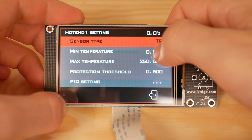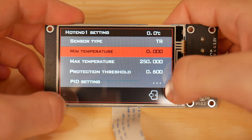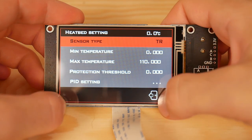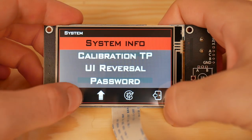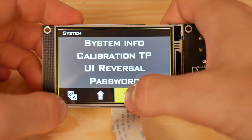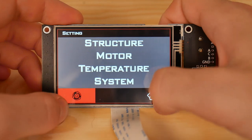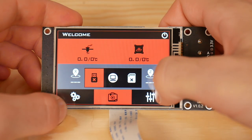It's got quite a few different preset color options, which is cool — doesn't affect overall functionality, but if you're building a cool machine, having the ability to control the overall UI is really neat. The board also has an LED hookup slot, which I think is pretty cool. Under the LCD screen there is an option for powering those LEDs on and off, rather than using a mechanical switch — being able to do it from the UI on the front of the machine is really neat for when you want to check on a print at night or just turn the lights off. You can also set the max and min temperatures as well as PID tuning, and the home screen UI looks really, really sleek.